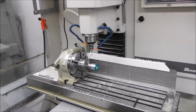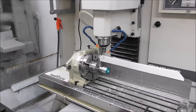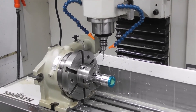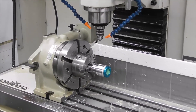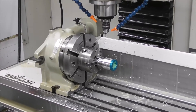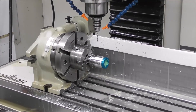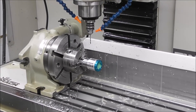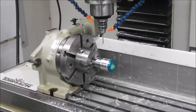When drilling, you want to avoid getting chips wrapping around the drill and causing a rat's nest. There are several good reasons: the rat's nest stops coolant from reaching the cutting edge because it's spinning as a barrier; it tempts you to manually remove it, which isn't safe; and you should be away doing something else while the CNC is running. You can set the drilling operation to avoid this — use a short peck with a full retract and a fairly heavy feed rate for the RPM, and you'll get short stiff chips coming out cleanly.